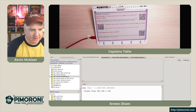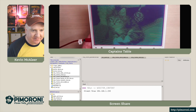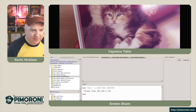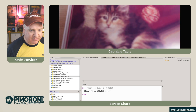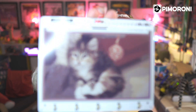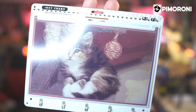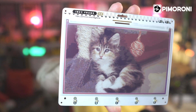Let's try the PlaceKitten example. Again, it's connecting to the internet. The picture's now coming through — we'll see that cat sort of springing into life. If I bring this really close to the camera, you can see that's a really sharp image. Those flickering effects are just the camera. So let me unplug this from power. Look how sharp that is — you can see there's a slight bit of dithering, and that's how images are displayed on something that's only got seven colours. But look at the viewing angle — it doesn't change depending on which angle you view it from.